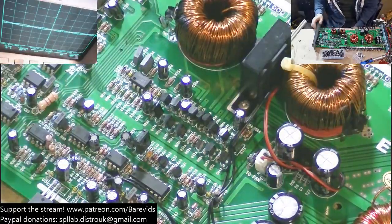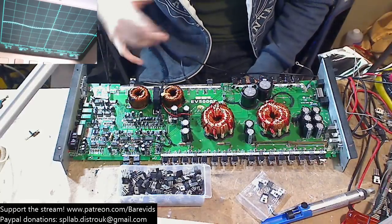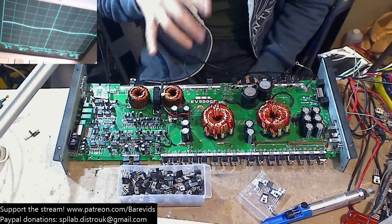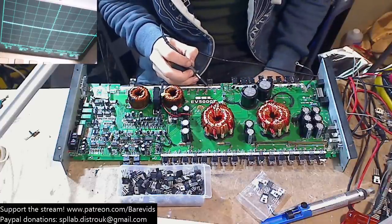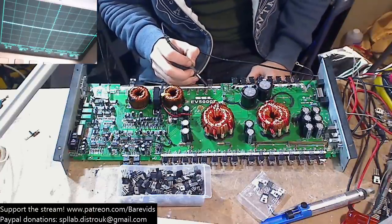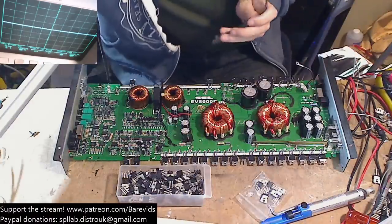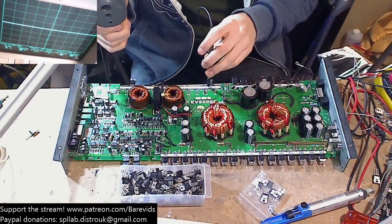Yeah, see, that's interesting because this amplifier is already drawing more current with the FETs in place, but it's not switching. So that leads me to believe that there is some leakage somewhere, which is probably in the drive circuit. So with the FETs in, let's see, is the drive circuit heating up more than it was before? Because it's obviously drawing more current.